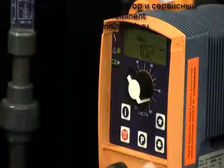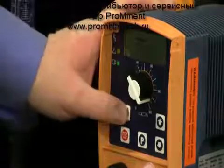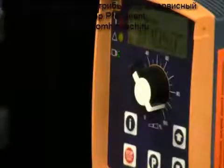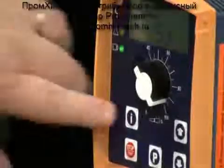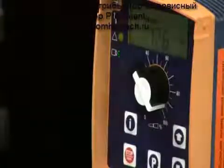And that's how we calibrate our Gamma L pump. One of the additional features is that it's also totalizing the flow — the amount that we've pumped — so we can keep track of chemical usage that way. And that's the calibration of our control version Gamma L pump. I'll see you next time.